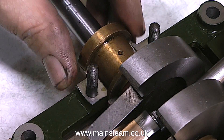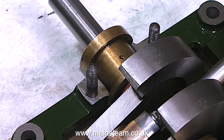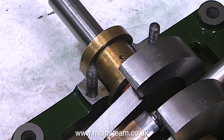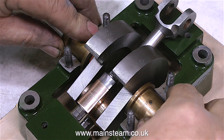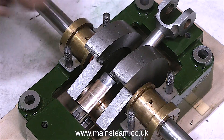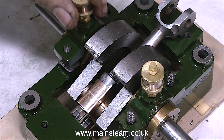If you remember from the section on machining these bushes, I cut a groove all the way round, so even if the hole in the bush is not at the top, the oil will still get to the bearing. This clip shows me fitting both of the top bearings simultaneously. These are no longer bearings though — they're just acting as clamps to hold the bushes in place.